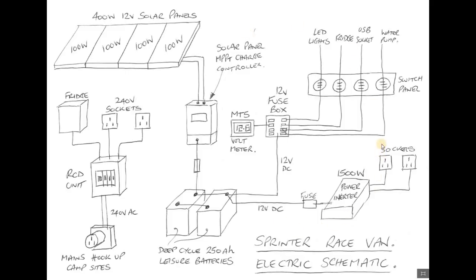There are two separate systems here - a mains voltage system and a 12 volt DC system - and this can get very confusing. There can be a lot of wiring; I've potentially got to run two separate sets of wires out to two separate sets of sockets. I don't really want to do that, so I want to come up with a way to combine all of this into one simple panel with a common point where I can select whether I want to use shore power or inverter power from the solar panels.